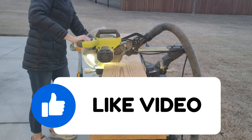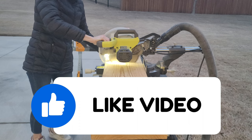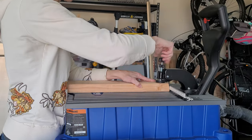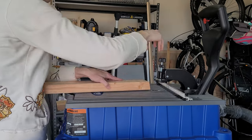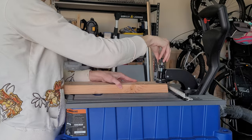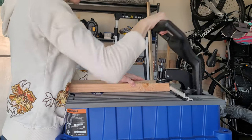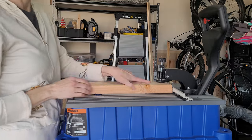A little wobble is just fine and easy to correct. So now I'm cutting my two by twelve board — it was just some extra left over from my rolling cart design, and I will link that below in the description. This is my pocket hole jig. It is so ergonomic, it has saved my shoulder big time. I'm drilling two pocket holes on each leg. The pocket holes will go inside the legs because we don't want you to see them from the outside. After you drill your eight pocket holes, you are ready to set up and line up where they're going to go.